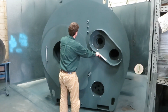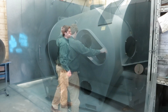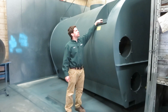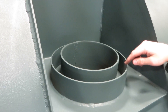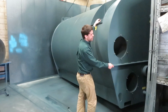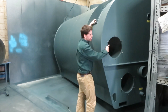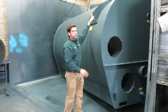I'm going to spin this unit and show you where the flue is. The air comes from that last exhaust run in the blower housing, comes through here, and goes vertical. This is where your flue connection is — it's a 10-inch UL-103HT or Class A flue. Back here is a collection box and clean-out where any large particles of ash will settle before going out vertically.